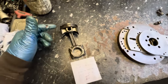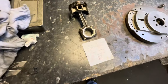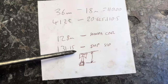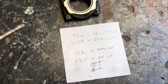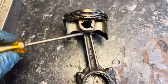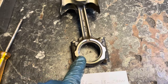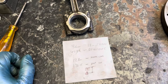From the top deck to the centre line of the crank pin: on the Honda CBR it's 128mm. On the Imp it's 131.15mm — so 3.15mm shorter overall. Although the actual rod length centre-to-centre is longer on the Honda because it's got a shorter compression height. So I know that if I take 3mm off the top of the Imp block, I can run this piston and rod. However, it's on a very small big end — 36mm — whereas the Imp is on 41.25mm, which is 1 and 5/8 inches for the big end pin.